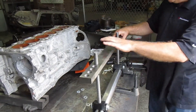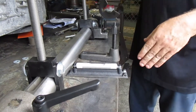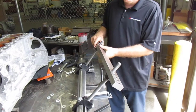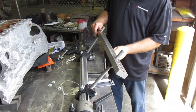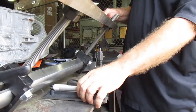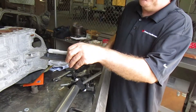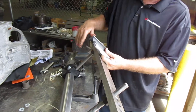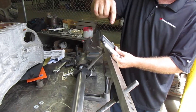The first thing you're going to do is make sure your table is level with a machinist level from front to back, left to right. Then you're going to offset your engine so one side of your heads or your block is level. You've got a standoff here that's going to support one side of your block. Then you're going to use this to adjust the level of your block from front to back, side to side. Once you have your level set, you're going to be ready to either plane your V8, plane your head gasket surface, or bore out your cylinder.